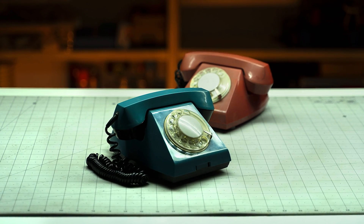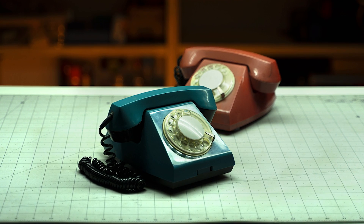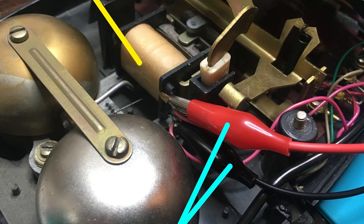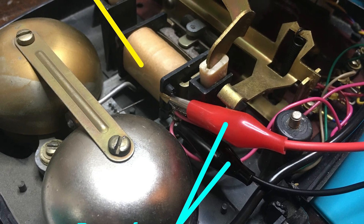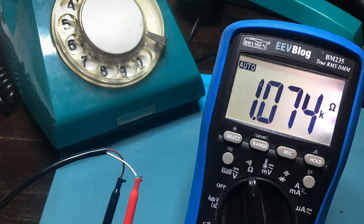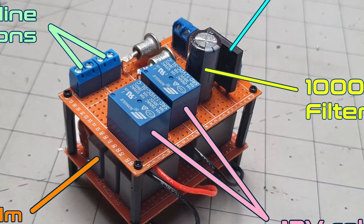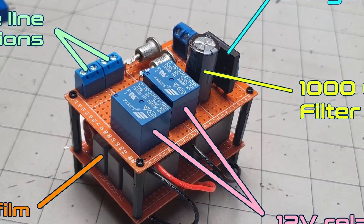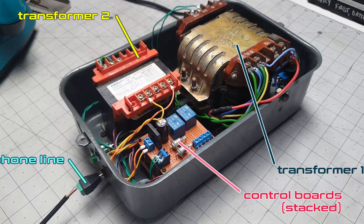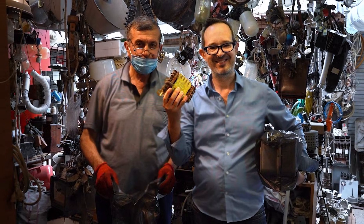From Hackaday, I learned about this project by Thomas to hack old Soviet-era rotary phones into an intercom for his family's computer repair business. He wanted the other phone to ring when you pick up the receiver, and when the other receiver is picked up, you can then talk. It almost seemed a little too easy, since all you need is 15 volts DC to do the talking part. But the ringing part is a little trickier, since that requires alternating current — meaning he needed two separate transformers, one for AC and one for DC. If you love the idea of restoring and hacking old hardware, it's hard not to love this one.